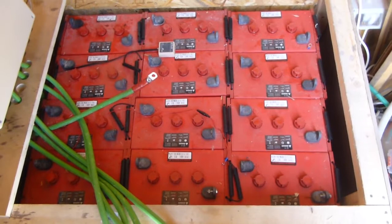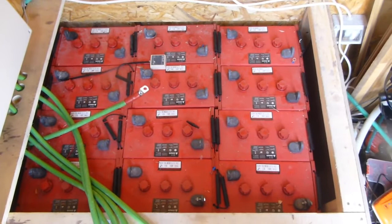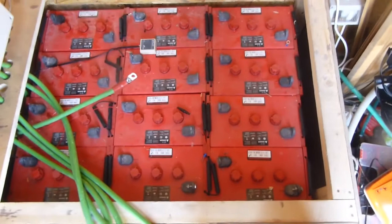These things weigh a ton. Then I have to remake the wires and wire it all back up. Seeing as it's all clear now, it's also a good time to clean the batteries with some bicarbonate of soda and water, to make sure there's not a film of electrolyte over the top which causes them to discharge quickly. There's a bit of corrosion on a couple of the terminals, so I'll clean those as well.